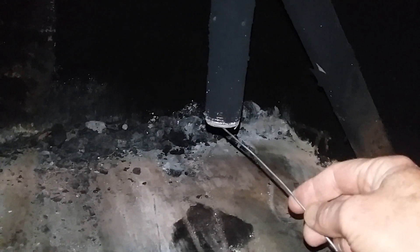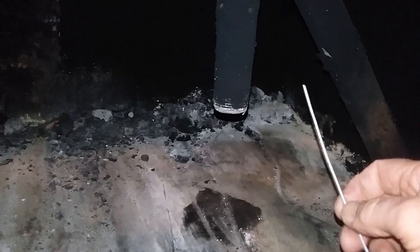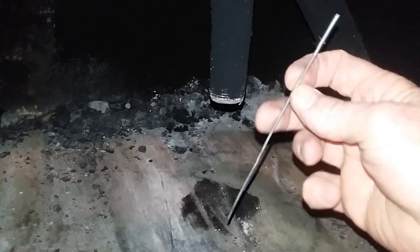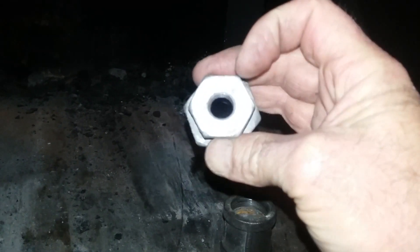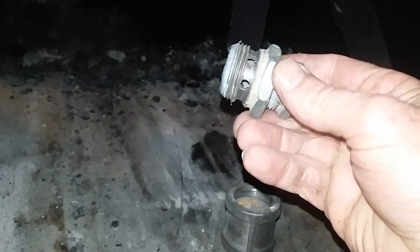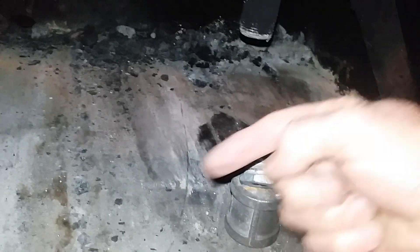The problem I've been getting is that it runs down one side and drips — it doesn't drip down the center because it's too hard to get that copper tube to drip in the center. So what I'm going to do is put a couple of little bends in this wire so I can slide it inside the copper tube, and then it will stay, and I can bend the end of the wire towards the center. Here's the new nozzle I'm going to try: it's just a coupler with some reducing bushings from one inch down to quarter inch, and I drilled holes on the side at an angle to blow air out and down.